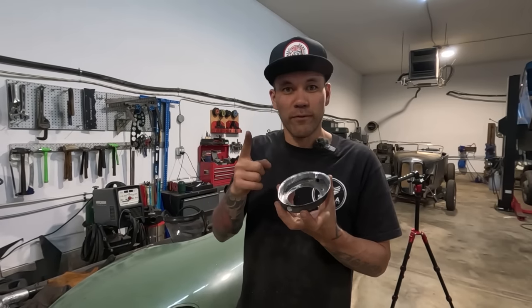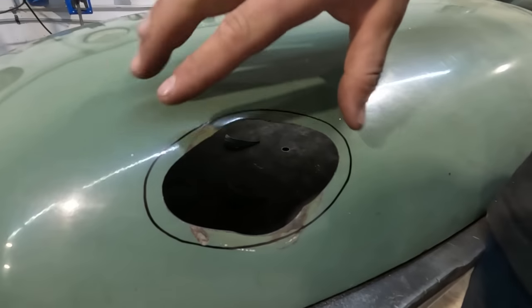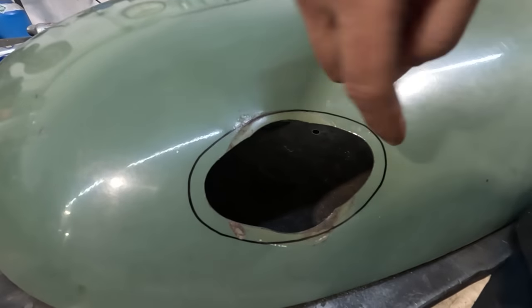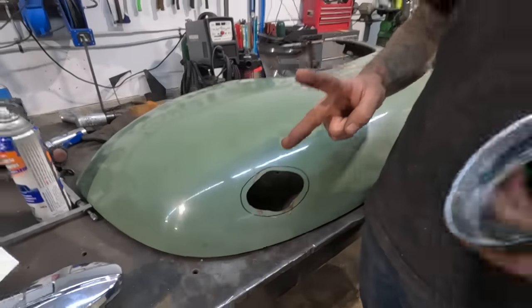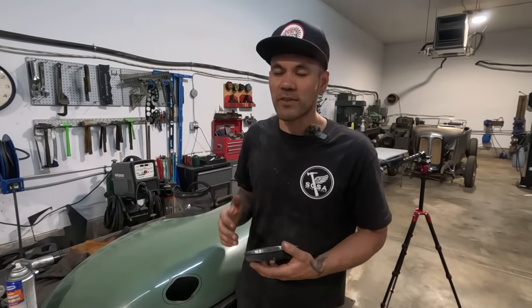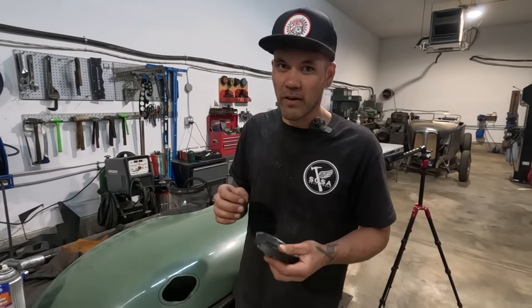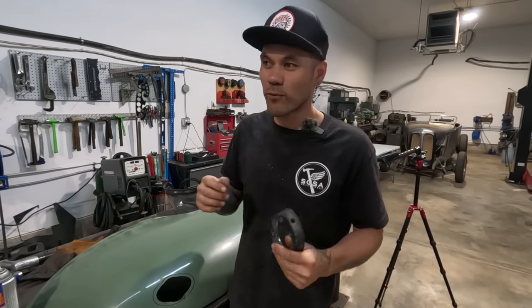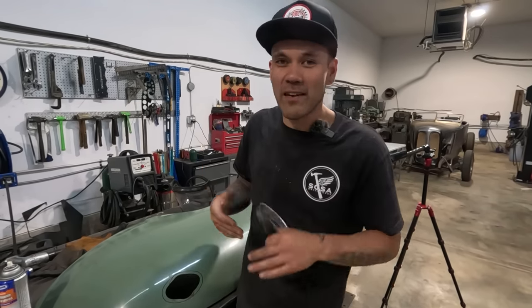What if we were to drill the holes first? If we drill the holes first right now, number one, it will be easier to drill these holes facing out this way just because we can get at it, rather than if these holes were on the inside, it would be a little bit more difficult. Number two is that if we have holes in this flange while we're using our flange turning tool, I know that because there's a hole in the flange, it will be weaker in that spot and it will allow it to stretch a little bit easier. So if we have a bunch of holes that we're gonna be putting in it anyway, why don't we try putting them in first and allowing those spots to stretch easier? I think, if I'm thinking ahead, this might be overthinking, but.